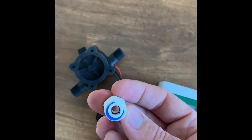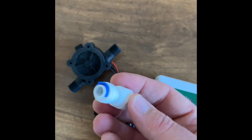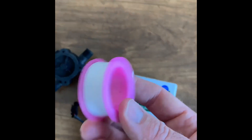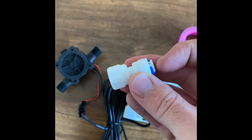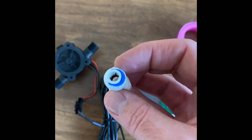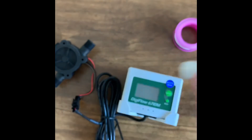I've bought these fittings to go along with it - that's a quarter-inch BSP thread on one end and a quarter-inch push-fit pipe fitting on the other. These parts I got off eBay, really easy to find. All you need is a bit of thread tape - put it around the threads, fit the fitting on, and then simply push the pipe in. Remember when pushing the pipe in, put a mark on the pipe so you can see how far it's gone in, because it can be deceiving. It has to connect right to the back where the washer is - make sure it's inserted fully otherwise you will get leaks.